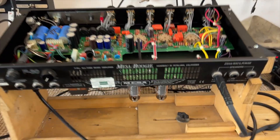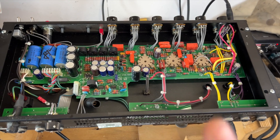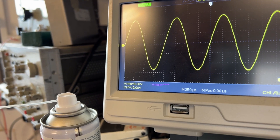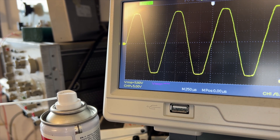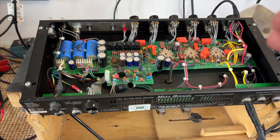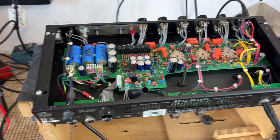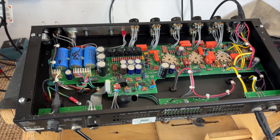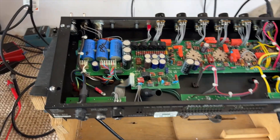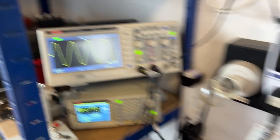The customer has approved a new set of EL84s. I've fitted them in the amp and checked the bias — all good. We're now matched within one milliamp, which I'm perfectly happy with. Checking the amp on the scope: we've now got a much higher output. It was barely getting above five volts peak to peak — we're now at nearly 12. So this amplifier is performing a lot healthier than it was before. Good news. I'm going to leave it burning in for a couple of hours, make sure I'm happy with it, then recheck all the measurements, make sure nothing's shifted, tweak the bias again if required, then reassemble it back in the cabinet. Both channels are working — in fact, all three channels. We'll call that one good.